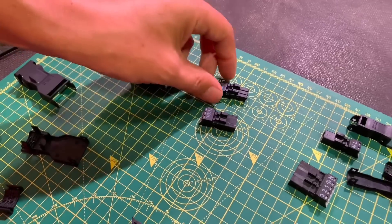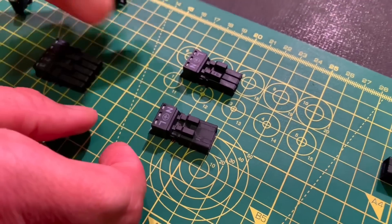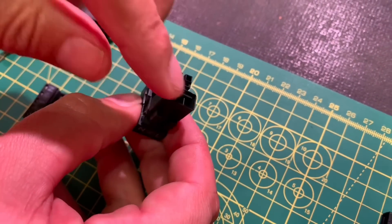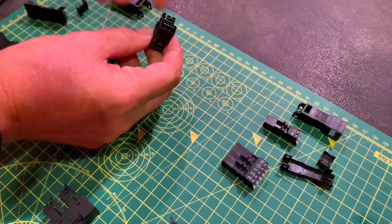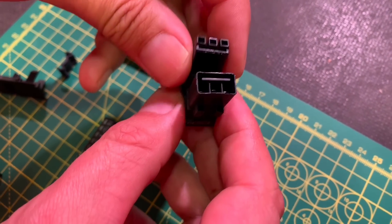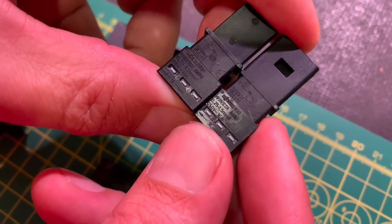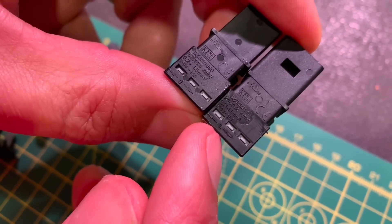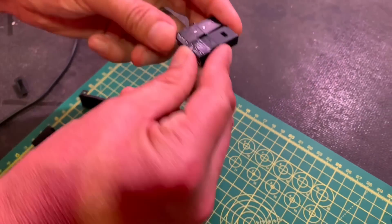We've got male and female connectors — here's a three-way version with line, neutral, and a CPC connection. The great thing is both sides of the connector are touch-proof, so you can't get a shock from those when they're unmated. As ever with WAGO, there's bags of information printed almost as full spec sheets on the connector itself, including cable and current-carrying capacity, down to the strip length of the conductor.